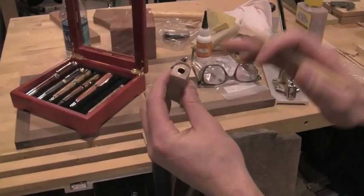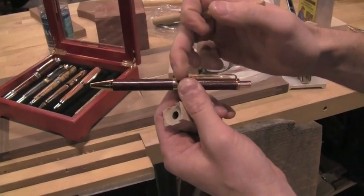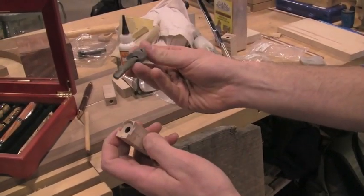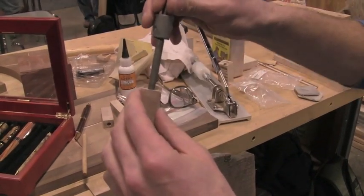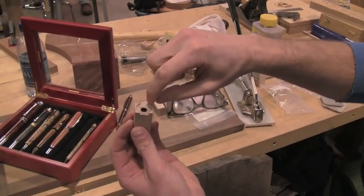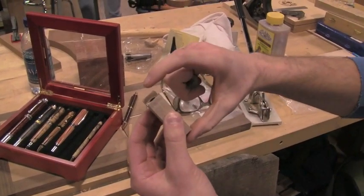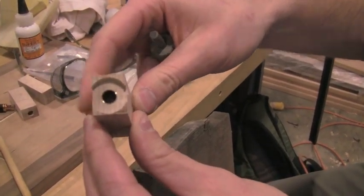You'll have some excess glue dribbling out on the sides — just take a quick paper towel and mop it up. The next step is to make sure that the end of your wood is perpendicular to your barrel and square. This ensures a good joint surface between your pen mechanism and your wood. The tool for this is the barrel trimmer, which is sized for the brass tube. It will also clean out any glue stuck on the inside of the tube. Insert it into your pen vise, put it on the drill press, and go in slowly until you see little curls of brass. You can see what it looks like untrimmed versus trimmed.